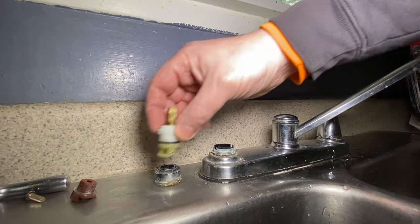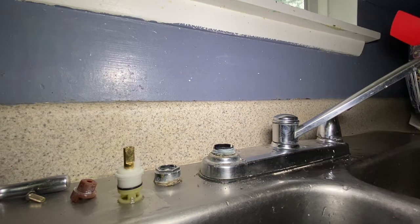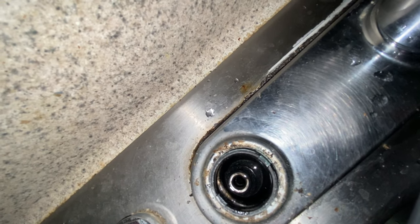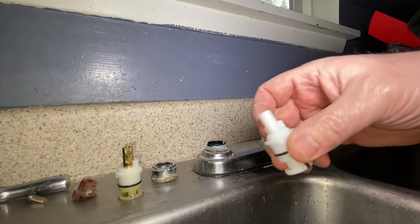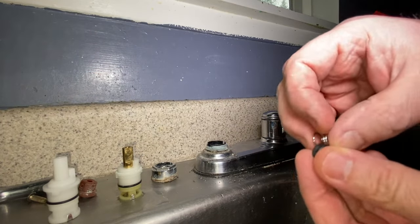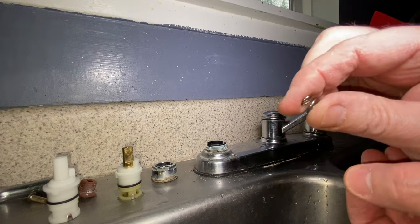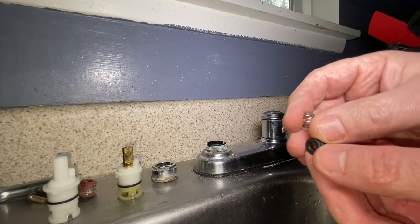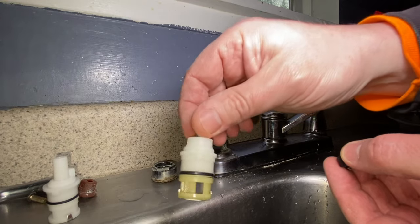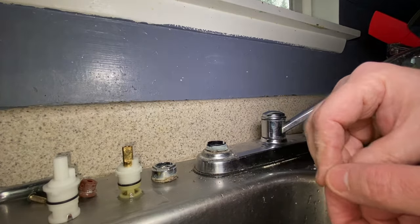So this just went in here right like that. You're going to still want an Allen wrench to get down in here. But I can see already that the seat is actually gone. The fact that this was moving all weird and you'd turn it to the back and it turned back on — we're actually going to change this out as well. Inside there is going to be a spring and a seat. You can only actually see the spring down in there right now, so this is just worn away. If the piece hadn't been turning all wonky, we could have just left it, but we're going to go ahead and pop it out since we bought the whole thing anyway.